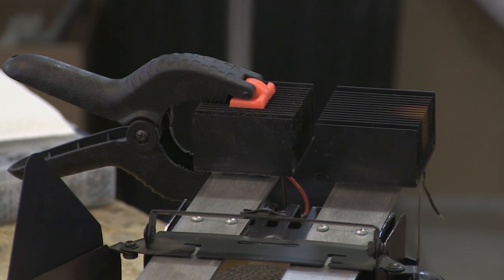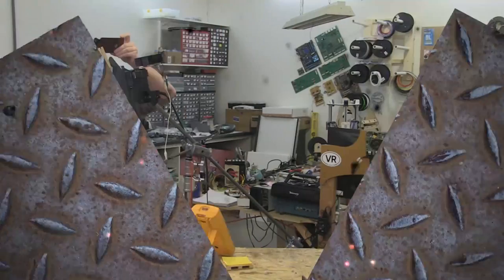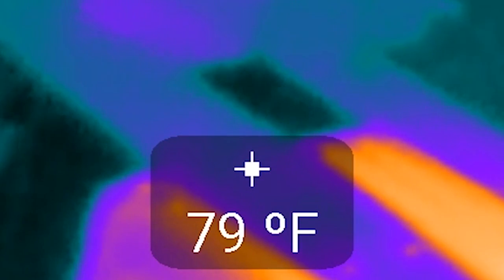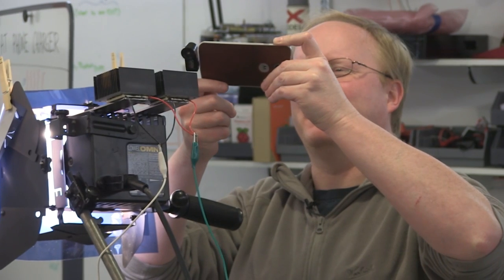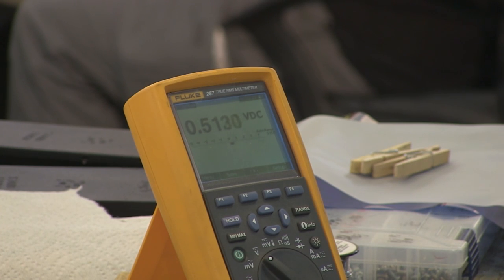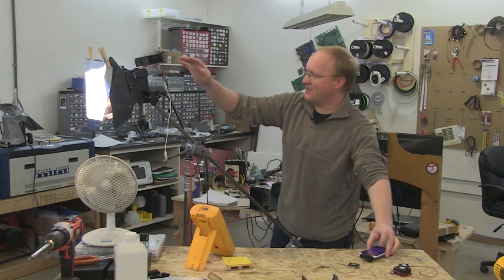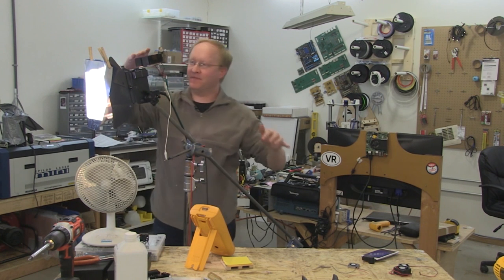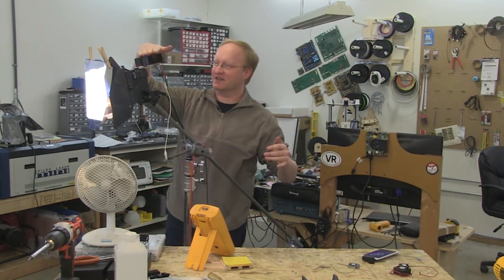Let's let these sit and then we can do some tests. The two steel plates aren't really conducting that much heat — I'm only reading about 100 degrees in either of them. We got about 0.5 volts and that's coming off of them in parallel. My thought was that by keeping this away from the light there'd be enough of a temperature difference, but I think these steel plates aren't conductive enough and not enough heat is being pulled from the heat sinks. I'm not sure what the solution is.